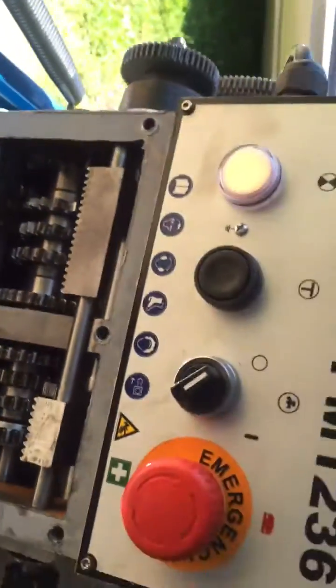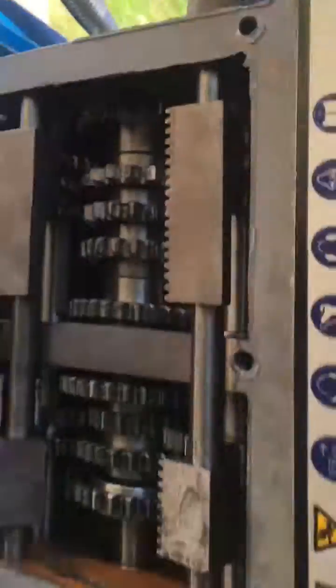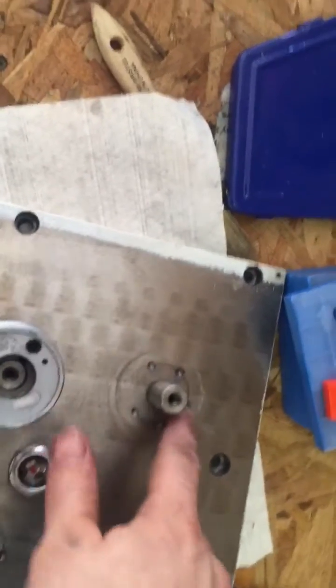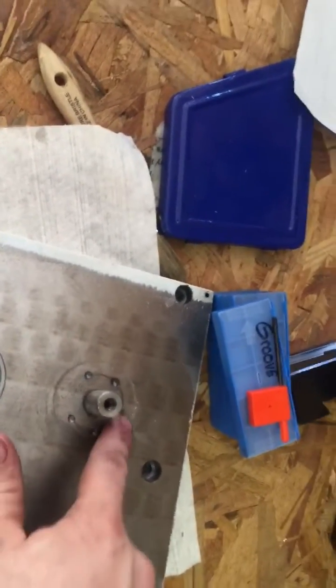For future reference, you have to drain the oil when doing this. Also, on the bench here — I was taking the knobs off — don't do that. See right here there's little holes; that's for the detent ball to go in there, with a spring behind it.